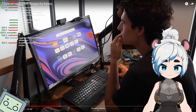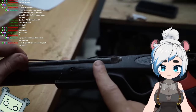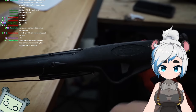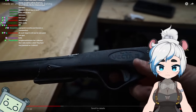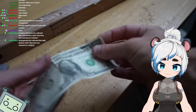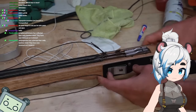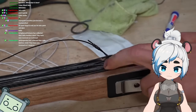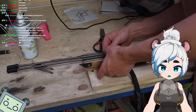The pokers also act as a wrap-around point for the line connected to the spear. I need a line attached to the spear otherwise the fish just run away with it when you shoot them. Most spear guns have a little hook on the side that the line wraps around and releases when you shoot. I don't want to put one on each side as it seems annoying and a tangle risk. My next idea was to use money clips — I'm a rich YouTuber — which I'd attach to the side so the line clips in and releases when you shoot. However, I think I've discovered a better way: loop one end of the line around this and then loop it over the fin of the spear, which releases when I shoot.